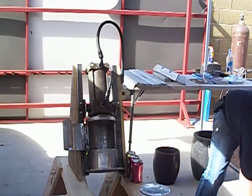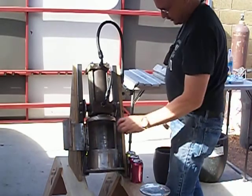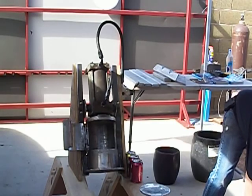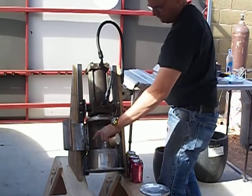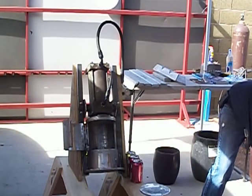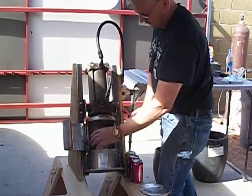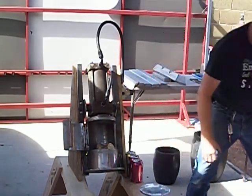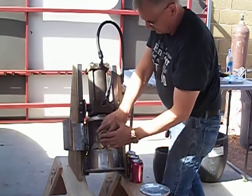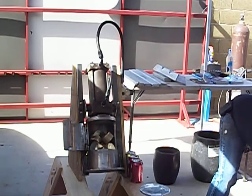Well, soda cans are not the only BS we deal with. So I also have these cat food cans. And they're all weird sizes and shapes. Drop them in there. Get a bunch of them in there. And make can aluminum out of that one. They're also pretty much pure aluminum, so they can be easily deep drawn, but not cracking and all that. Tedious. Build them up. Get a bed of them started.